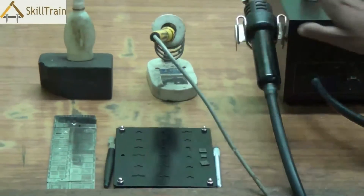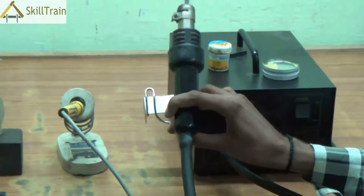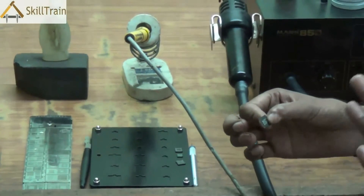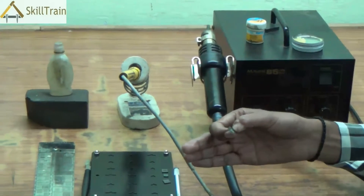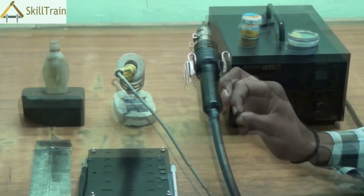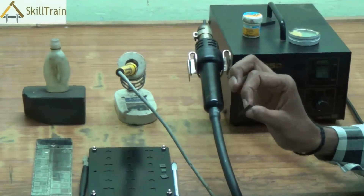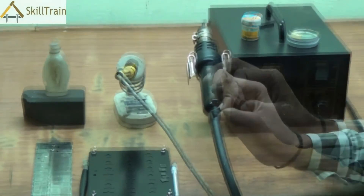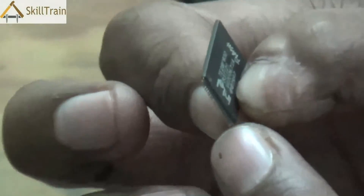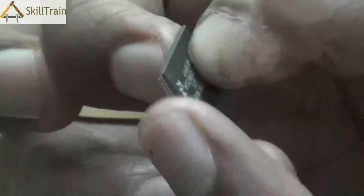These ICs can also be removed using the hot air gun or SMD. These ICs are very easy to place on the board because it just requires a micro soldering iron to solder them on the sides, and you can use the hot air gun or SMD to remove them from the mobile PCB. However, in order to do this you will need to practice a lot. The reason is that the tips of these ICs are very minute, as you can see on screen. These leads are very minute, so you need to be very careful when soldering them onto the PCB. These leads should not touch each other, otherwise it can result in a short circuit.